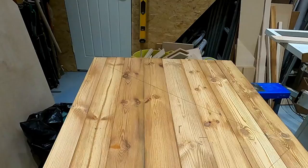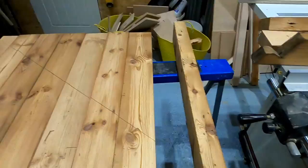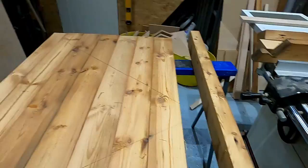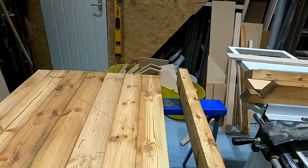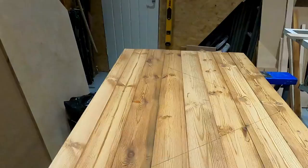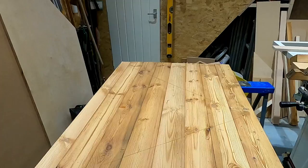So I'm going to glue them up now. I think I'm going to put some biscuits in just to help line them up for the glue-up — just two or three in each one. I'm going to have to be careful because of these nail holes, and where I punched some nails in that I couldn't get out, I need to make sure I put the biscuits where there's no nail hole, so I don't risk hitting a nail with my biscuit cutter. I've drawn a triangle on there because I've laid them out as they look quite nice, so I'll know which order they go in when I put them back together.